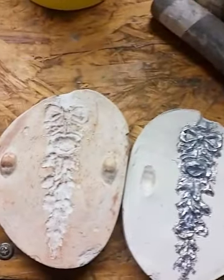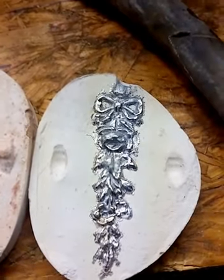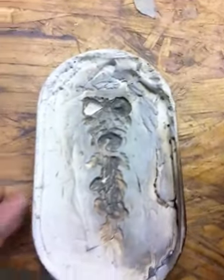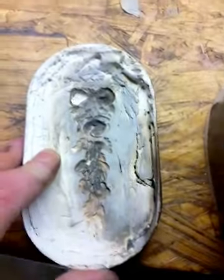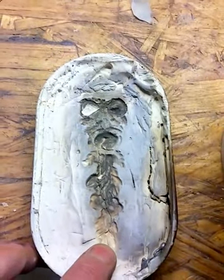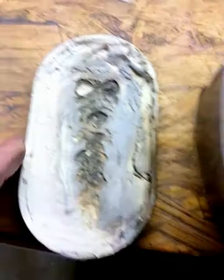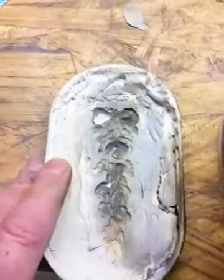So I cut a piece of it off and melted it down. I tried two different molds. The first one I just used a sardine can, put plaster repair in it, and put the ornament on it. You could tell it's not level — it kind of shrunk up on me too. I don't know if it was the type of plaster I was using or what, but I did some research and everybody's making molds out of plaster repair. This was a one-part mold and I didn't like the results, although it turned out okay — it wasn't perfect.